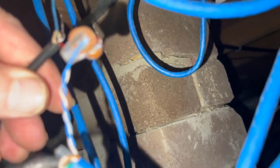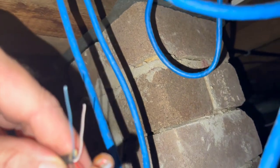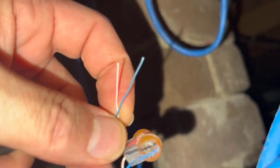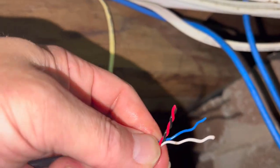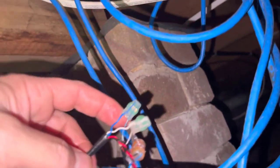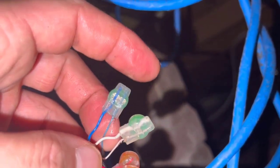Just for the customer's reference, the red-black pair is connected to this other cable here. I would say that is the second pair going down to the granny flat on a separate cable. There are two cables coming in the starter pipe from the pit — both stuck in the conduit. This pair here is likely feeding the granny flat with a second separate service. Also for reference, this is that cheap, crappy two-pair cable I've seen a few times — I think they must order it from overseas. I'm not sure it meets Australian Standard. The gel is different — it's not like that standard white grease.